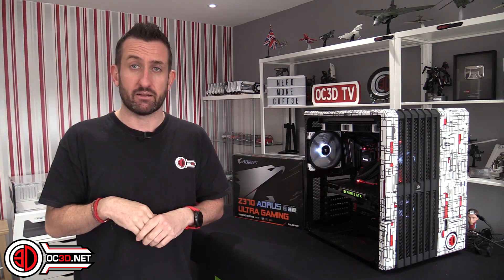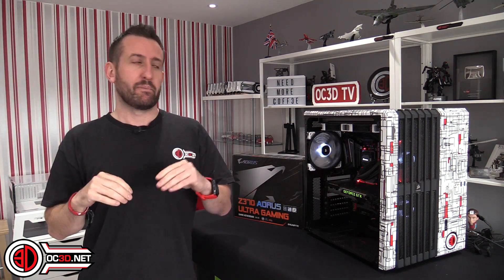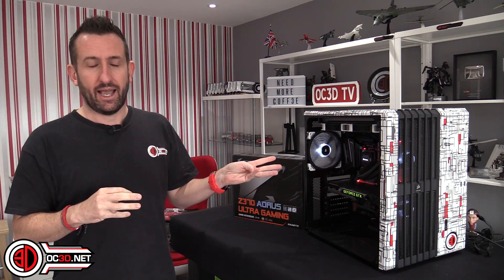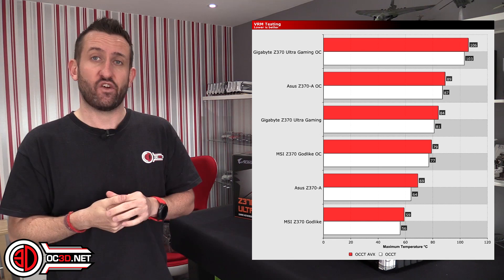The differences may only be minor in the grand scheme of things, but when you're trying to formulate an opinion about products that are essentially quite similar, those few numbers can make a big difference. The real problem with this board wasn't even the mid-range performance — it really came when I started doing testing with a full-blown load. At stock, running the 8700K, the VRMs were getting as hot as the VRMs on the MSI Godlike were getting with a 5GHz overclock.